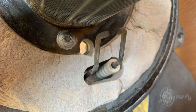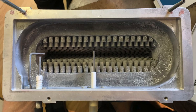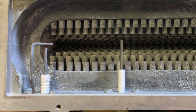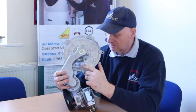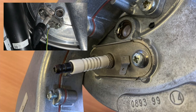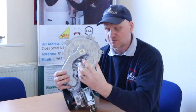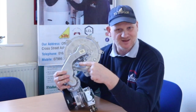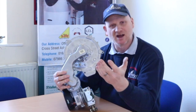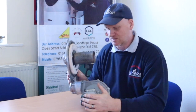The other control you can see here is ignition flame rectification. We've got two probes here — some of these boilers still have a separate flame rectification probe but this one uses the same component, like a spark plug with an HT lead on the ignition cable. It also uses an earth cable because the ignition needs an earth to go to ground to work. It sends an AC current which then turns to DC, and the PCB knows it's ignited and burning 360 degrees around the burner.